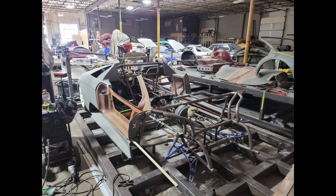So at this point, this was actually the very first picture we took of separating the panels. When we got this body, it was just a one-piece deal — there weren't separate panels for quarter panels or fenders or anything like that. So at this point we started the separation after we tabbed out the locations of where the panels were going to mount up, and then we started getting in deep to all the spots that we couldn't reach with the welder with the body on there.